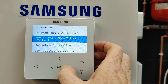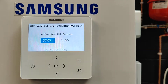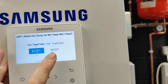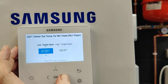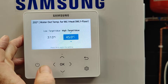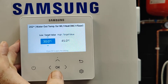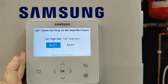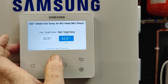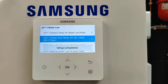Next go to 202* and press okay. This sets the water temperature: when the weather outside is warmer, radiators will be at 37°C; when colder, 50°C. For underfloor heating, set the high to 45°C maximum. Nowadays I'd suggest setting the low around 30°C for underfloor, or 32-33°C for radiators, going up to 50°C. If you have a combination of radiators and underfloor, always use the higher radiator settings. Press okay when done.